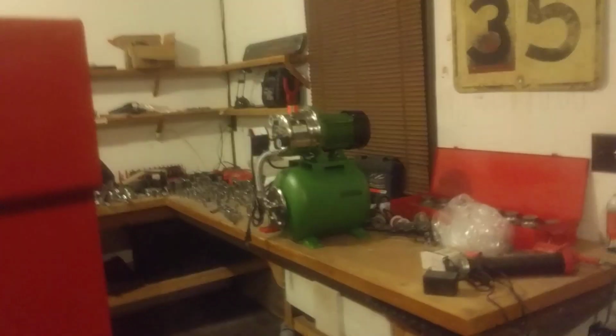Come to find, I actually have 200 amp at this service. It's 200 amp service at this house. I've got a 100 amp sub panel inside the house, and I've probably got 100 amps running to here, would be my guess. I don't know exactly how it's split up. I'd have to go out and look at the big panel outside. But before I get too far ahead of myself with a million projects here, I'll probably run that about the same height as that 240 that is running over there for that air conditioner. I'll run that one on the bottom because I'm going to need 2 more probably run over here at least, especially if I don't end up using that outlet for this pump, because one will have to go down and out to the well house, and then another will be used for this pump here.